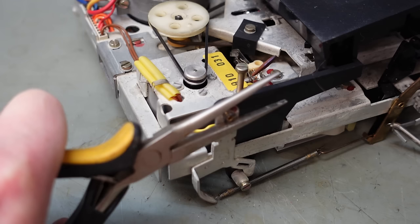The output of this tape deck is on this DIN connector here, so I need to find a socket, which I've got here, so I can get to these pins. Just hook a probe onto there, that's one of the outputs. Ground in the centre. And the other channel, it's here on the right. Better move this spring off the board. That could be exciting. Yep, that one's quite safe there. We'll just power it on.